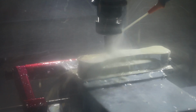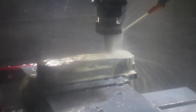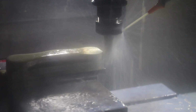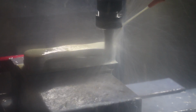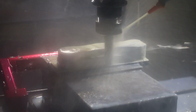So we're cutting off pieces. Those are pretty large, as metal chips go. These are about 6/1000 of an inch thick, by about half an inch tall. The stuff that I usually end up making is like this.